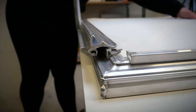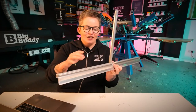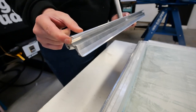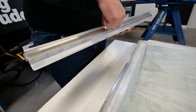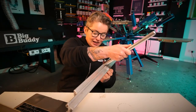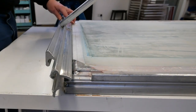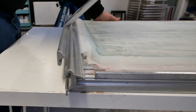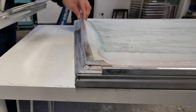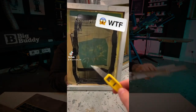And then when it comes to taking the mesh off, once you don't need it anymore, you've ripped it or it's just worn or something, you actually use this very, very top profile edge here. So you hold the tool like this, and it's got this edge that rounds off and then goes relatively sharp. You literally just put it in a groove and then pull it back as if you're tightening it, and then it just jumps off. Then you can quite easily go around the whole screen, and it gets easier and easier to take the sides off, and there you go. You've got your mesh panel off, and you didn't have to stab it and rip it off like how you'd probably want to if you can't figure that out.